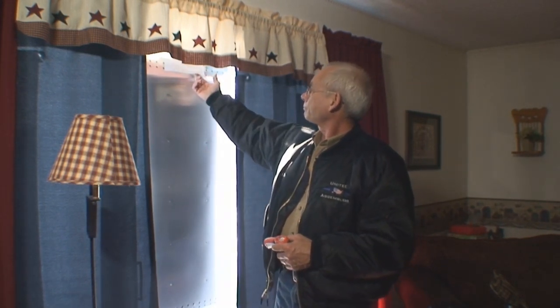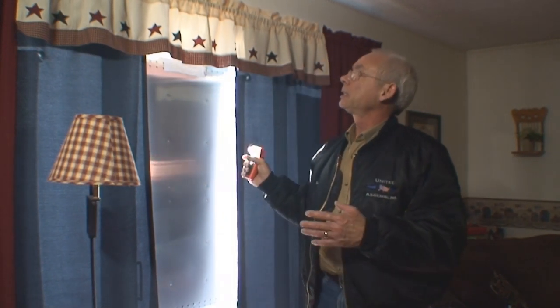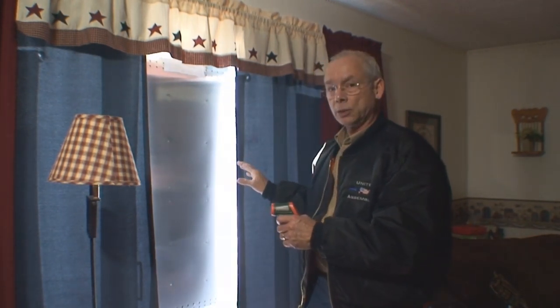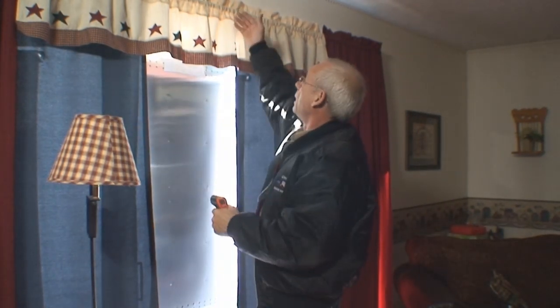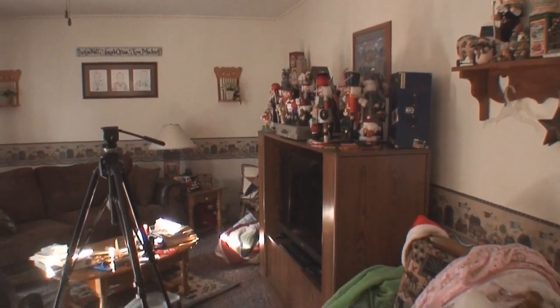As you can see, the tissues I have on the top of these panels show the airflow clearly — cooler air goes into the bottom, travels through the panel, heats up as it reaches the top, and then comes out the top. It's almost like it's got a blower in it, but it does not. As I close these curtains, the air goes up, and you can also leave the curtains open to allow more heated air to circulate through. The three panels heat up behind the curtain, the air goes up above the curtain, across the ceiling, and then the ceiling fan — set on winter — pulls all that hot air from the ceiling and pushes it down to room level.